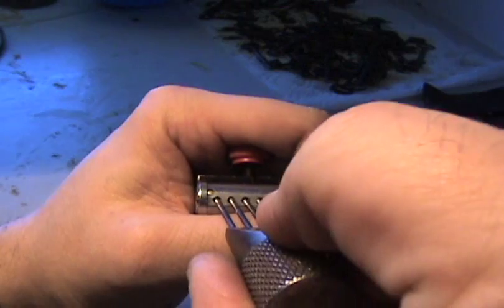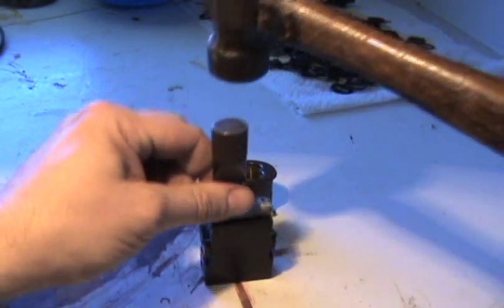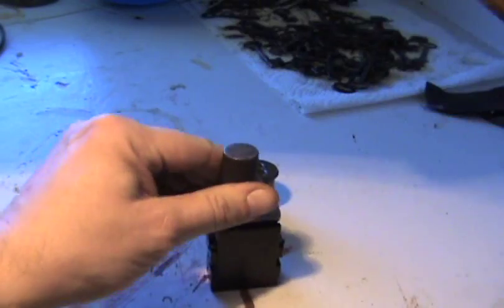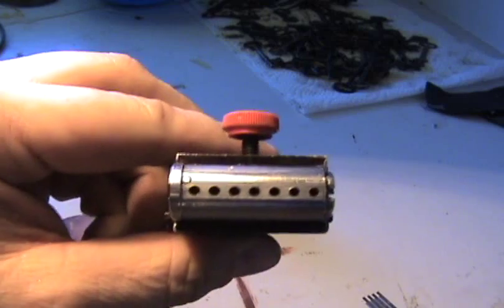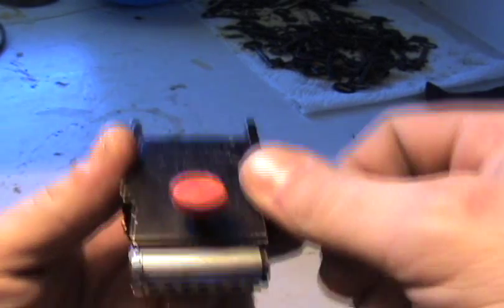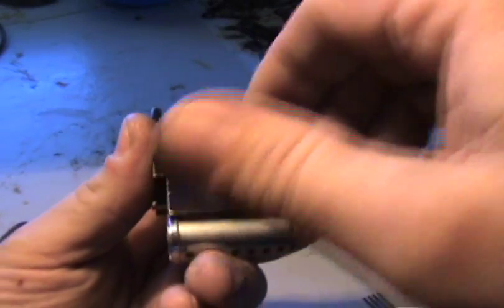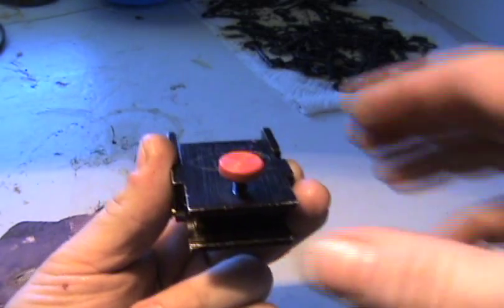So we'll do this — put the tool in. First four spots there. Move it over here so you can see it. Tap it down, cut the latches loose. You can see there it is — a seven pin cylinder. And then here is where you want to be careful. Loosen it up, slide the cylinder out, push it down and pop it.